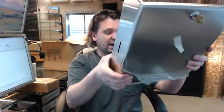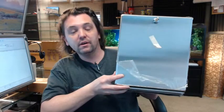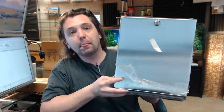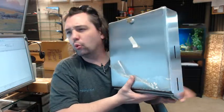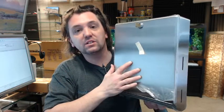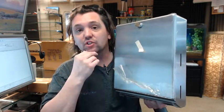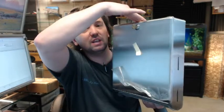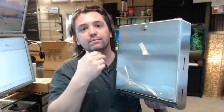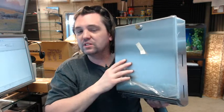Very nice quality item by Bobrick, with a continuous stainless hinge at the bottom. Regarding the key lock versus a thumb turn — which is the B-2620 — if you have an application where only a couple of people use the restroom and theft of paper towels is not a concern, the key can become a hassle because people end up leaving it on top or it gets lost. Sometimes, if vandalism is not a concern, the B-2620 with the thumb turn is a good idea.